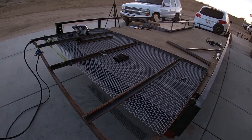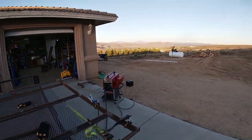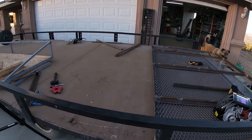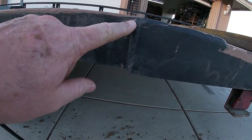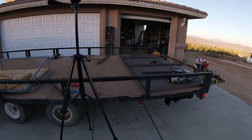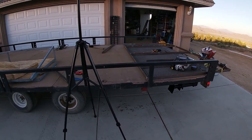I'm bummed I wanted to get this done, but I'm just going to have to wait — maybe I can get some time off midweek. I'm going to throw all this on the trailer and back it in on the side of the house. It's coming together. If you didn't know, this was a 14-foot trailer and you can see welds here and here — about 48 inches apart — it looks like somebody extended it. That's another reason why I like having those jacks touch the ground, so it takes all the load off that modification.